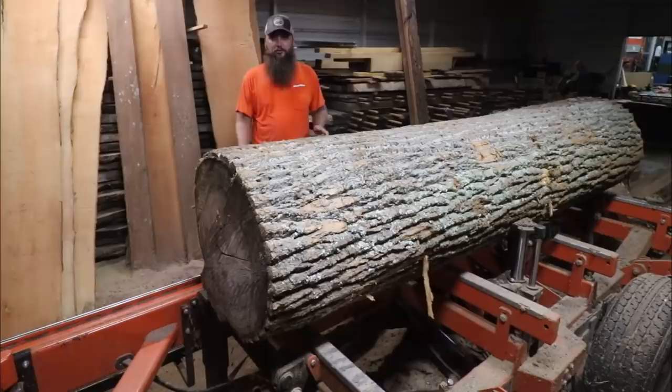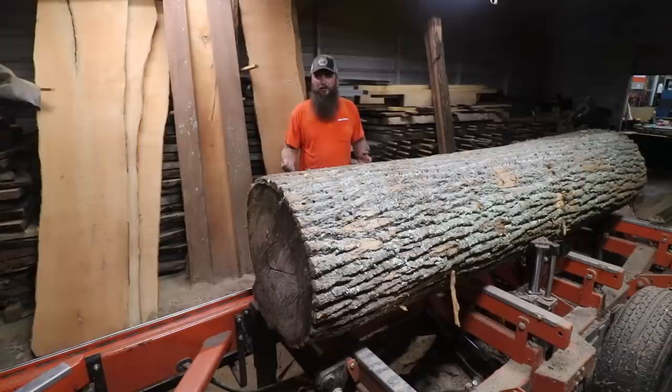You'll be okay doing that, but make sure you get it off the ground. You know, have about a 6-inch gap between the end of the board and the ground, and maybe even a seal board running around it, kind of binding the bottom of it there like white oak or something like that, because it will rot on you really fast if it gets a lot of water on it.